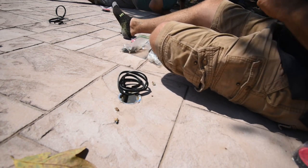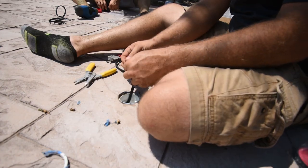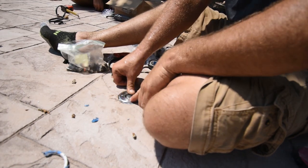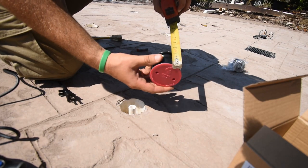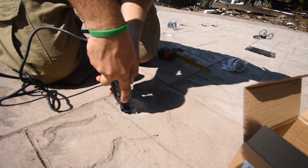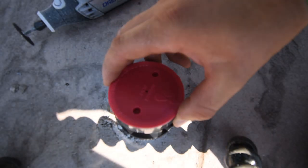When setting the sleeves for our lights, we put in an extra foot of slack on the lighting wire so that if we ever have to repair a light, we can snip it off and still have extra wire to connect to. For installing the nozzles, it would definitely be easier to do this ahead of time, but we were on a very tight schedule and the nozzles didn't come in until about two hours after we poured — that's why we used sleeves. On this pour, we used a Dremel to cut the pipe off to the height needed to set our nozzles into place.